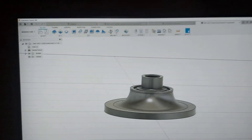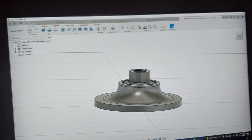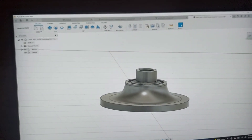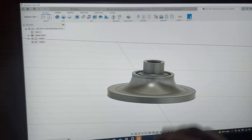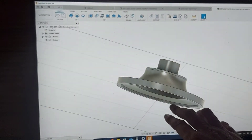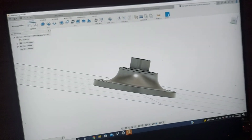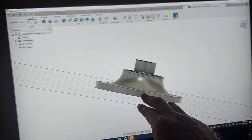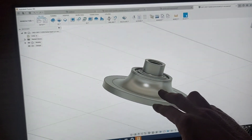I want the combustion chamber to be a little more woods-friendly. I was really shocked when I got the bike home — being a long-time four-stroke guy, I took it out and it is not woods-friendly. It has a lot of top-end power, as you'd expect from a two-stroke 250, but the bottom end is lacking. So we're going to change that — add some bark to the bottom and make the power curve a little more linear, because when you're in tight spaces in the trees you want something that pulls hard off the bottom.